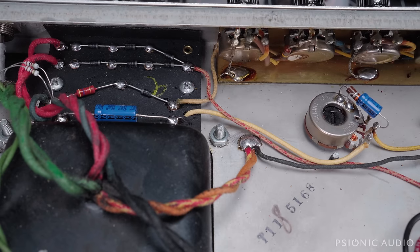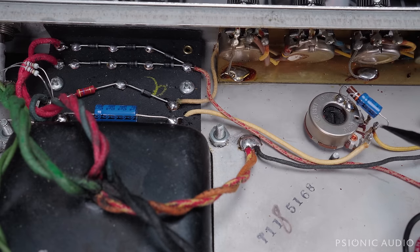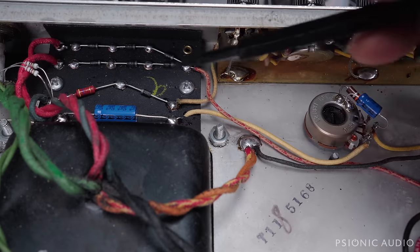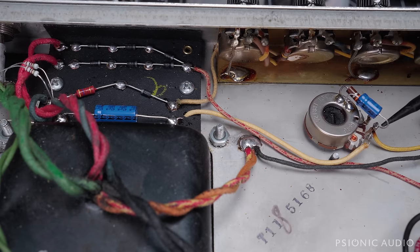This is a very surface-level explanation — you really need to read books on how this stuff works, or at least long chapters. You can see in later Fender circuits where they did add a 3K resistor and a little tab on the bias pot with an additional cap to ground. So Fender incorporated this idea in the 70s, and not every idea they had after Leo left was a bad one. That was a good idea, and here's how to implement it on this amp.